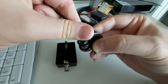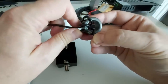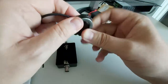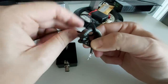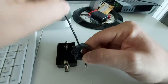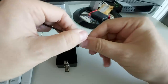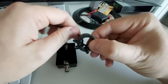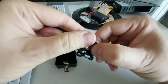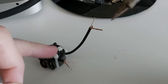You just don't want the wire to be loose, but you don't want it damaged either. I forgot to count — one, two, three, four... You have to be careful with tie wraps because if you squeeze the insulation too hard you're going to change the impedance, and that could be a problem for the SWR. You want the coax to cover about three-quarters of the toroid, and that's six turns — that's it. It's very simple.